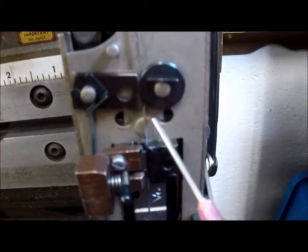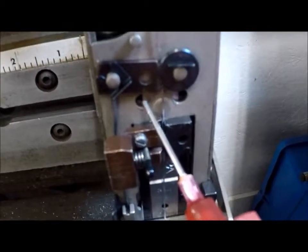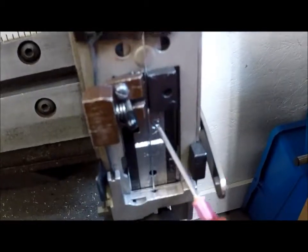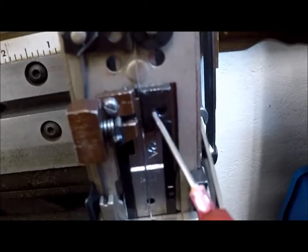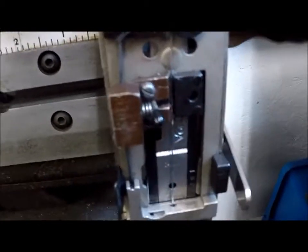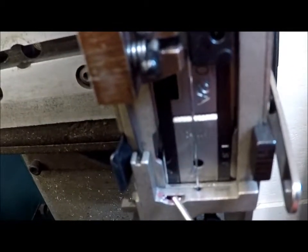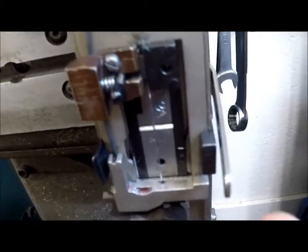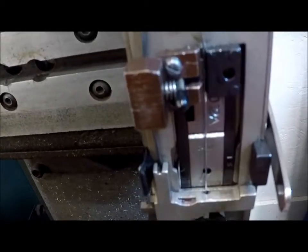Inside this front plate there's a hole — put a drop of oil back in there on that metal, a drop here and a drop there. That'll lubricate what's called the driver bar. By the grip — this is the grip — there's a hole here, put a drop of oil in that hole, that'll lubricate the part that slides. Right here there's a little groove, kind of on an angle, slanted — put a drop of oil in that. On this particular head there's a hole here — put oil in that, that'll lubricate the cutters, so the little slicing cutters will work fine and keep cutting the wire with no problem.